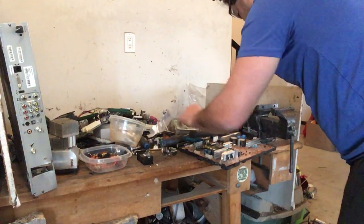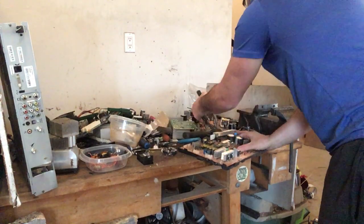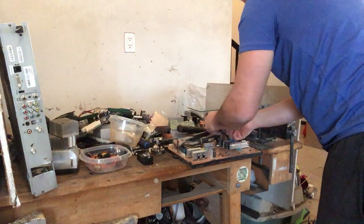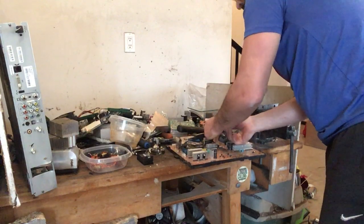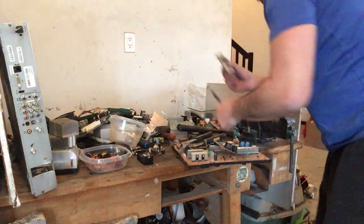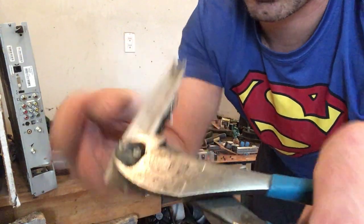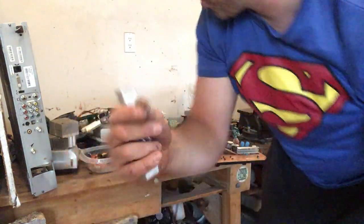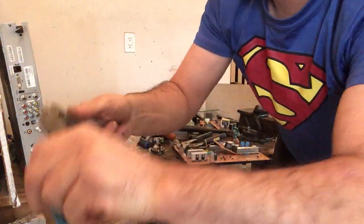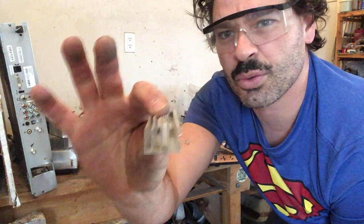These aluminum heat sinks are bracketed down, but if I just break it off — there are pins. You have to make sure before you start taking these off that you unscrew the clamps. But this again has a couple of magnetic pins that I have to pull out in order to get clean aluminum. Just pulling it out like that — boom, now it is clean. There's some number two and a beautiful extruded heat sink.